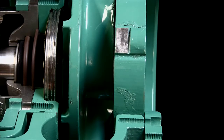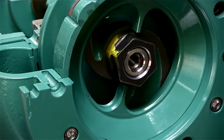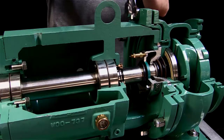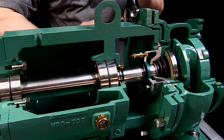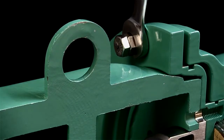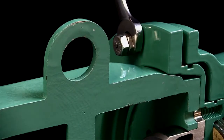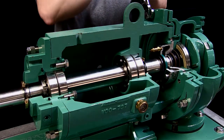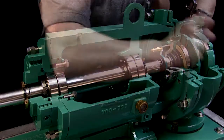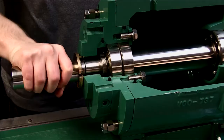Close up the gap until light contact occurs between impeller and cutter bar. When you have the cutters lightly touching, unclamp the adjustment sleeves once again, carefully rotate them two flats clockwise, and retighten the clamp bolts. This will yield an impeller to cutter bar clearance of about 20 to 24 thousandths — an acceptable number for all models of Vaughan HE and PE series chopper pumps, 3 inch through 16 inch.